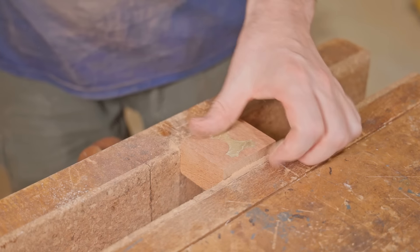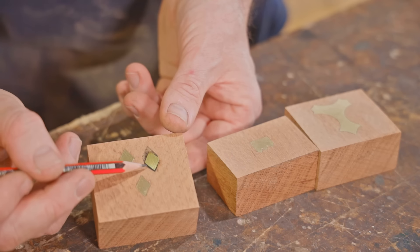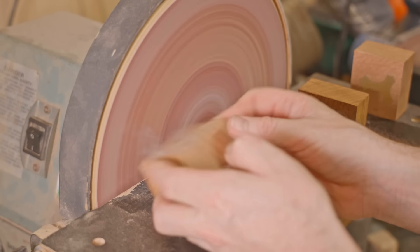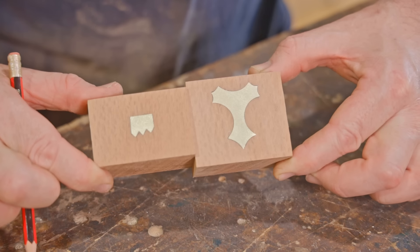That sanded to 120 grit, but I did sand it to 240 grit afterwards. I tried sanding the diamond one on the disc sander and that was far too aggressive — I made a mess of it and it got too hot and slipped. It's not the end of the world though as it's only a test piece. I reckon they came out really well and next I'll put some wax on them.